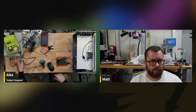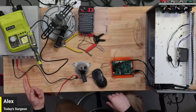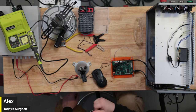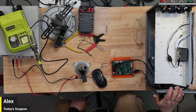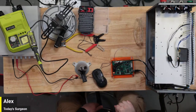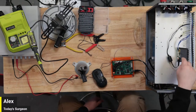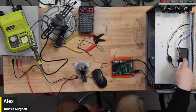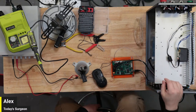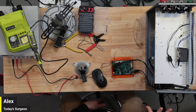And you can see if I turn the first channel on the power supply on, we will get a status indicator light here. Hopefully, yep, there it is. So we've got power to the board. We just have to turn on the rest of the machine. Everything else is the way that you guys saw it last time. So we have our little 5-volt, 3-amp power supply that we scavenged from the back room up here powering the new EasyCAD 3 board. That'll turn on, but we're not really using it right now, so that's fine. And everything else is the same.